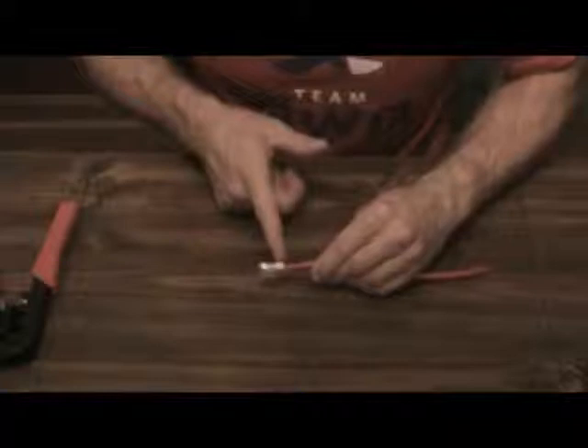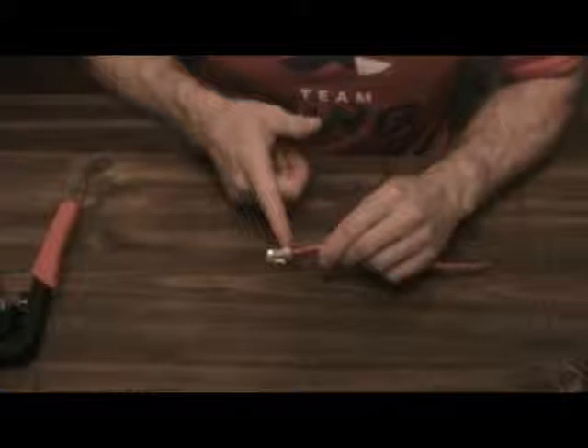I'm going to take the connector — this is the bottom side with orange on the left. I'll blow a little moisture into it and then slide it in carefully, making sure I don't get the wires out of order. As they start going into their respective slots without binding, I'll check the color code again, then walk it in with a wiggle and some pressure. What I'm looking for is all cables flush at the end, and the outer sheath moved past the tab on the back of the RJ45. That tab gets crimped in to grip the sheath and hold everything tight — if you don't do that, the connector can slide off and wires can break.